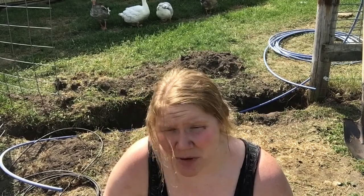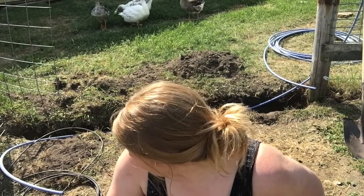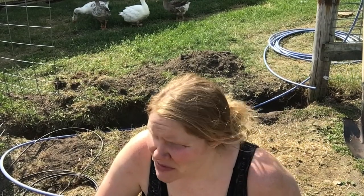I left a fair amount of extra tubing on either end, because once I run the wire through it I'm going to bend that end over. If you have the tube openings facing the sky when it rains, that moisture can get in there and cause corrosion problems. So you want to leave enough extra on the end to bend it over and then staple that to your fence post to keep moisture out. Next I'm going to run my wire through the tubing, trim it, and then we'll start burying — it's really not a long process.